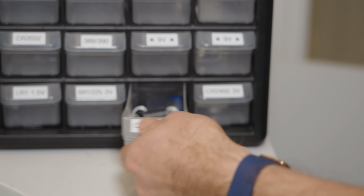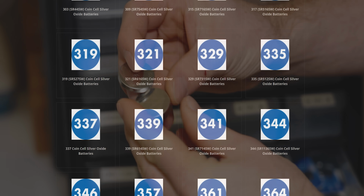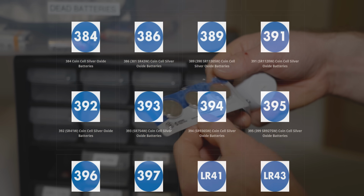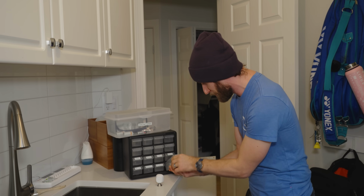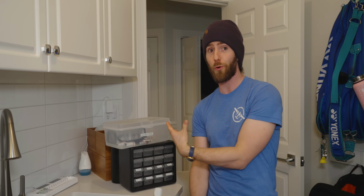I mean, they're mostly similar, generally kind of button shaped and 3-ish volts and lithium based, but they come in a wide variety of diameters and thicknesses to the point where trying to predict and stock everything you might need will make you feel like you're some kind of career procurement officer. But then you're good, right? Once you've got them all in your little organizer. Well, no. Like any batteries, they have a finite shelf life, so you can't order too many of them.